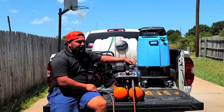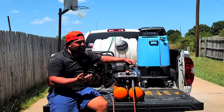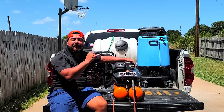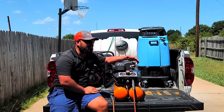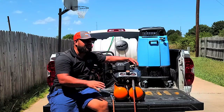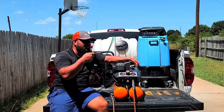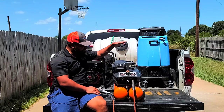As you guys saw previously, I had the 6-gallon air compressor, and in my eyes, 6 gallons, I was like, I have more air, right? But obviously, I'm very new to all this, the CFM and all that, so I never really paid attention to it till, as you start working more, you're like, dang, this thing loses air very quickly. And that's the issue I had with my 6-gallon air compressor. I would pull the trigger and real quickly the air would diminish, right? So it wasn't pulling the CFMs that I needed.